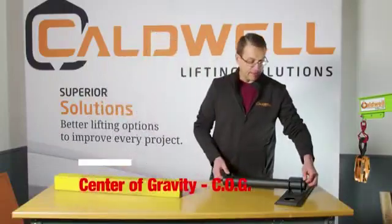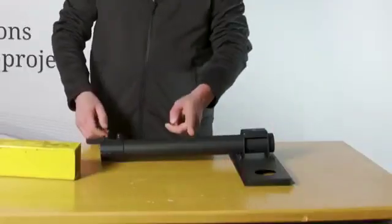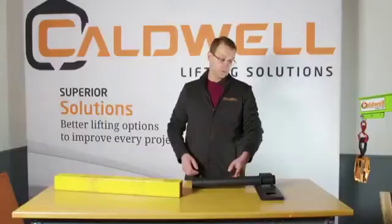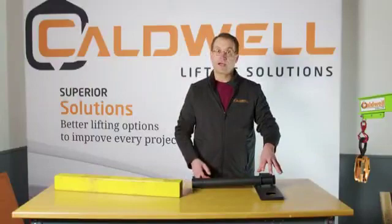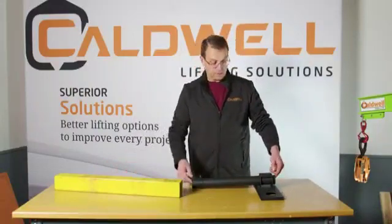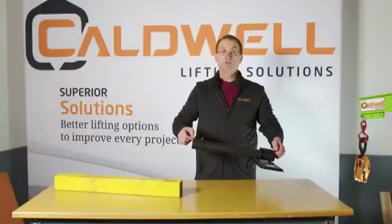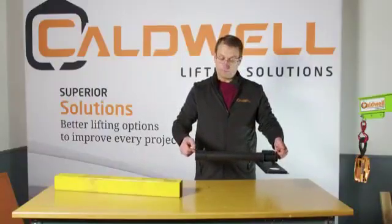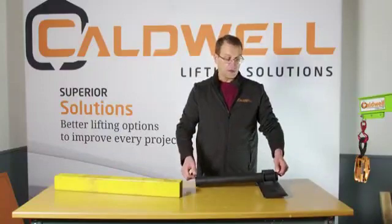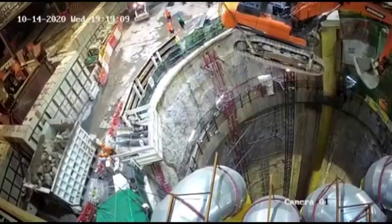But if we look at this object here, the center of gravity is not going to be exactly in the middle because there's more weight to this side. So if we were to lift in the same manner as we lifted this, it would tilt. That could be very dangerous in the lifting process. It could put loads into the lifting device that it's not designed for.